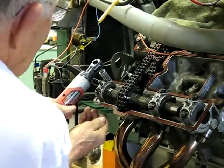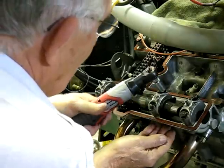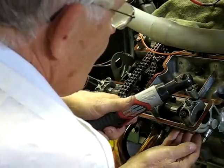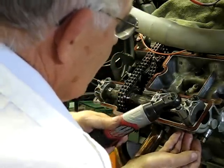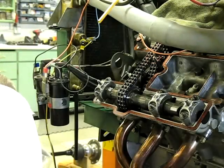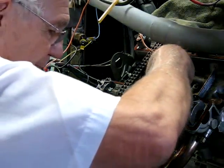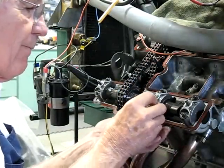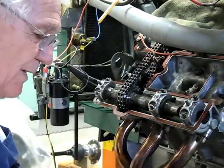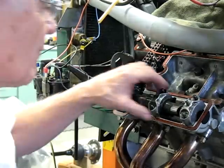So here we go, I'm going to take a look at it. Remove the washers. The washers have a chamfer — hard washers. Install them with the chamfer up when you put them back. Remove the bearing caps.